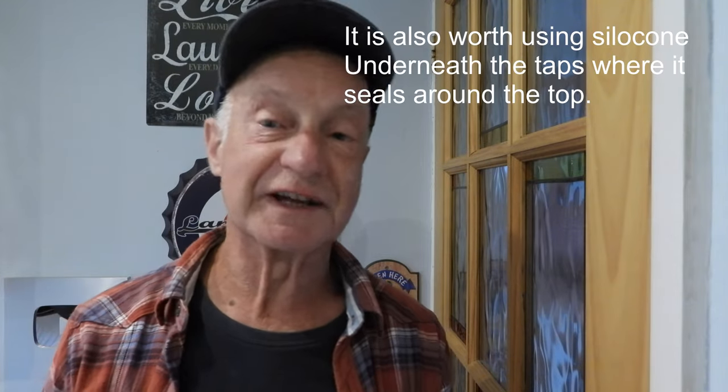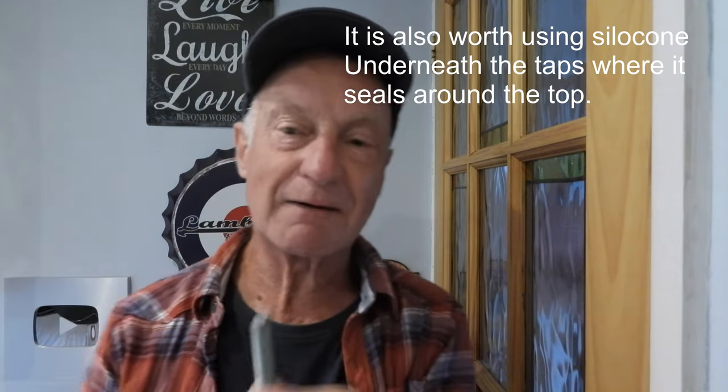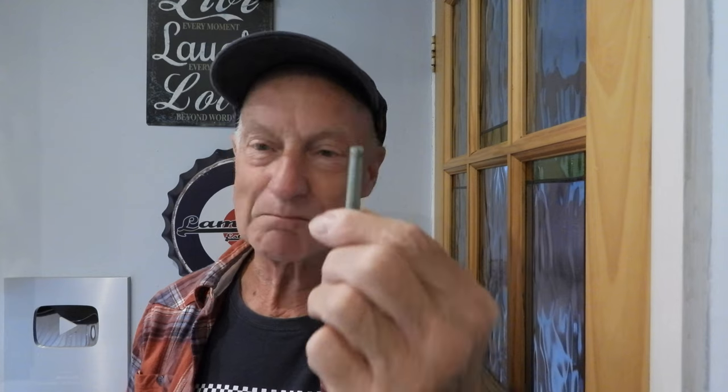That's going to stay pretty solid. Unfortunately, even though they do have a rubber washer and the same horseshoe shape that goes under the sink and bolts up to grip it, after a little while - especially if you've got kids swinging on the tap - it becomes loose in the actual basin or sink. Bear in mind that they often come loose simply because that one bolt is just not good enough. Two bolts is always best. Keep your taps tight!